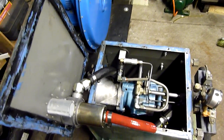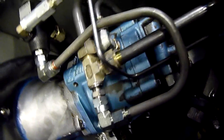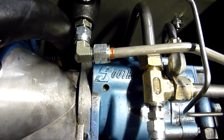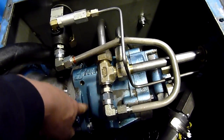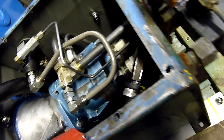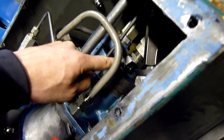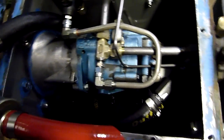There's a fitting down there that goes straight to tank. The pump itself — Southcorp or something like that — is fairly big. It looks like it's got a main bearing bypass bleeder that'll just spurt oil out back into the tank. Clearly this wouldn't work very well out of the tank. There also looks like a bypass valve there which will just discharge straight back into the tank.